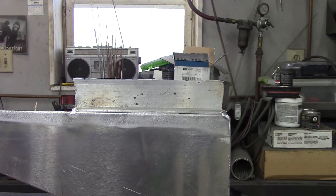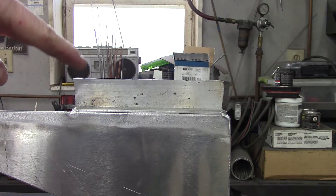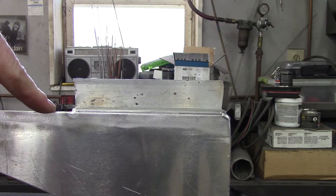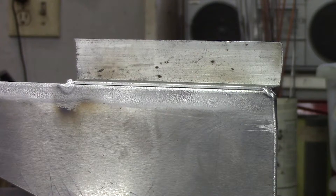I asked Immigration Freedom what thickness material he wanted me to weld. I have a piece of 1/16 inch angle here and a piece of 1/8 inch flat stock. He said two millimeter to three millimeter, so this covers both bases. I'm using argon for cover gas at 15 cubic feet per hour.